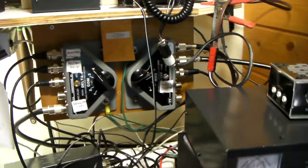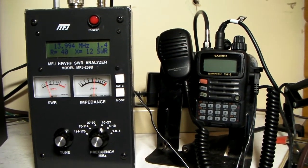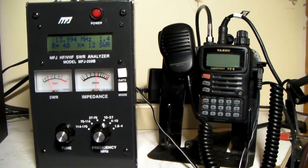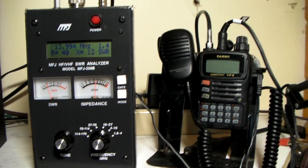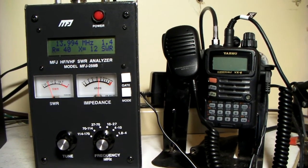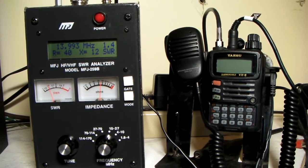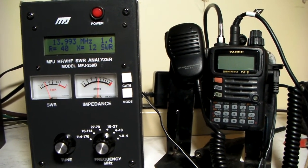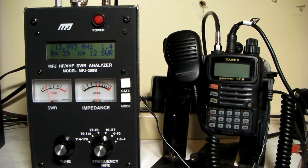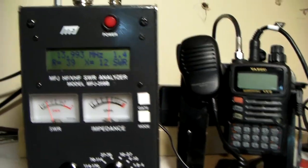So this is the epilogue. As it turned out, once I got the Yagi up in the air the resonant peak did not change back to what I had measured on the sawhorses in my original setup. That was a little disappointing, but that's what happens when you make assumptions. At the suggestion of K1WTX, I lowered the Yagi and this time reoriented it so that the driven element was closest to the ground and the director was above it. And sure enough, I was able to get the thing to come in really well — and this is the result.